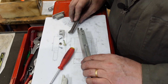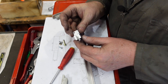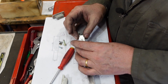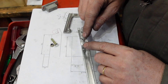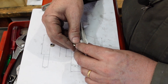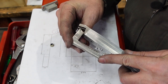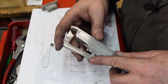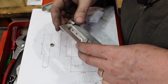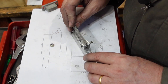To attach this to the arm I need a bracket that looks like that — pretty straightforward to make. There is one trick and I'll show you that in a minute, but that'll just screw on there and sit in there. I've got a bolt that's too long just to locate there and you can see the action is fine — that'll just pinch the shank of the tap and hold it there. So all I need now is something here that will keep that pressure on and I'm pretty much done.